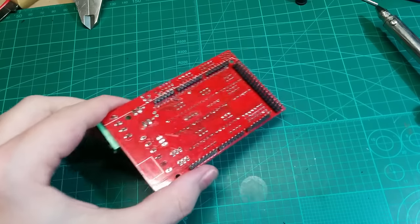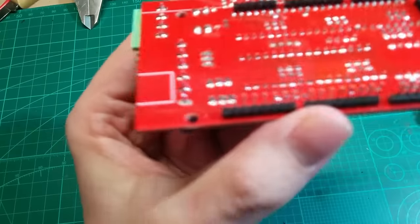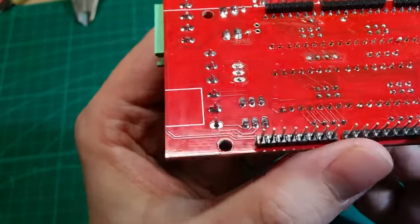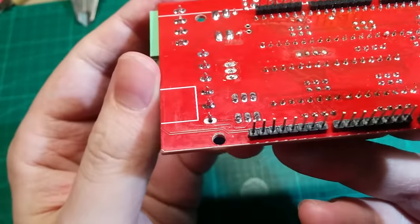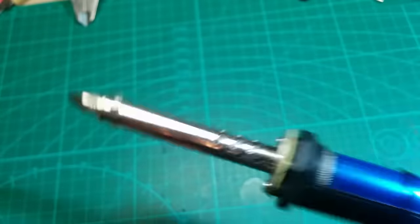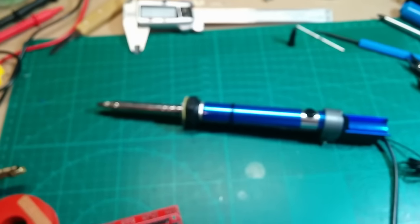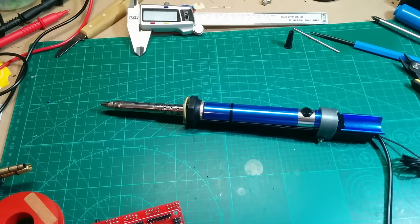Just for kicks let's try one of these connectors. It might sound counterintuitive, but if you want to desolder something it's sometimes easier to put more solder on first to get it off easier - and here you see that's pretty clean. I think this was a successful mod of this cheap solder sucker. But still, if you can afford it, buy the right tool in the first place and not buy two tools to make one - but it was a nice experience.